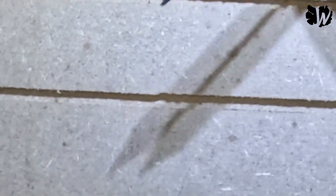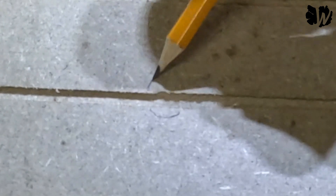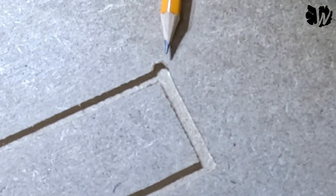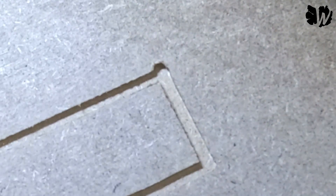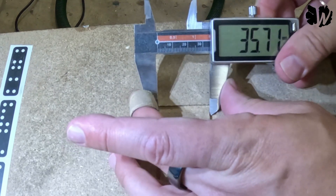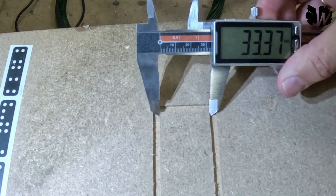I continue cutting the line, finish the rectangle, and now you can see that this led to problems. Where I plunged the router back in, there is a small deviation, and then at the end where both lines meet you can see that those lines no longer match. There is a significant deviation — when we measure this, you can see there is a total deviation of about two millimeters caused by this.